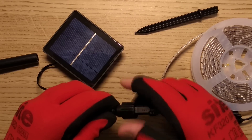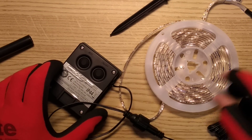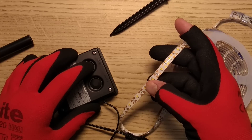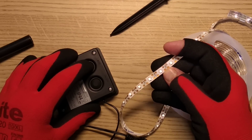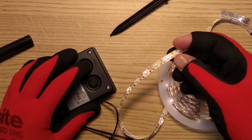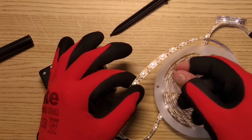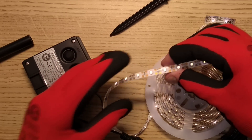I don't even know what battery is in this - I have not had this open. So let's turn it face down. It's got two buttons: on and off. That's on, by the way, and then mode. From the fact that it's one of these two-channel things, it means it's using polarity reversal to actually light or switch the LEDs. So when you turn it to continuous on - it's got lots of patterns, lots of useless Christmas light patterns - it'll actually be a bit dimmer because it's alternating at a 50-50 ratio between the two circuits at very high speed. The pulse modulation isn't being picked up by the camera.